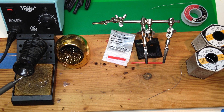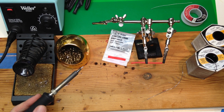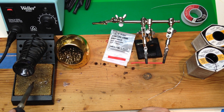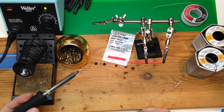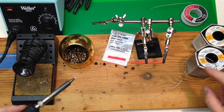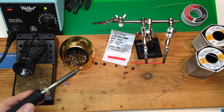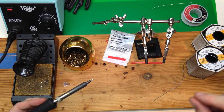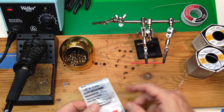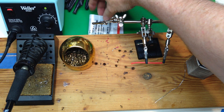Let's look at the tip. If we had looked at it just a minute ago, you would have seen that the tip was kind of oxidized and not very clean. What you do is you might have a sponge on your base — get that wet and just clean off your tip. That will make it nice and shiny. You might also have one of these tip cleaners, like the Hakko tip cleaner — it's brass with rosin. Stick it in there and give it a nice twist, and it comes out nice and clean and shiny. If it doesn't come out clean and shiny, your tip is no good. Get yourself a new tip. 1/8th inch is good for bigger things, 1/16th is good for smaller work, but no matter the size you'll still be able to do it — just a little bit more or less convenient.